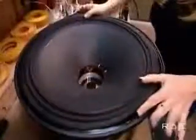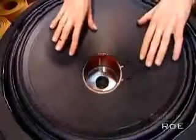After slipping the voice coil between the front plate and the core, they glue on the bottom suspension — flexible fabric rings that move with the voice coil and prevent it from rubbing on the magnetic structure. Next they glue the cone, usually made of cardboard, plastic, or metal. Then they solder the electrical connections: current from the amplifier travels by wire to the two terminals, and the terminal wires connect to the voice coil wires.